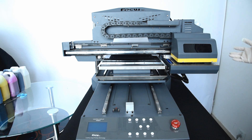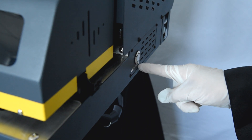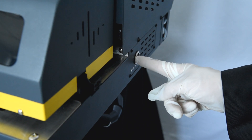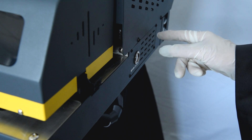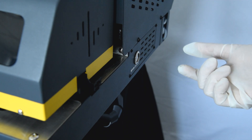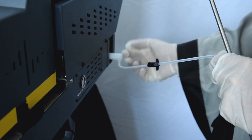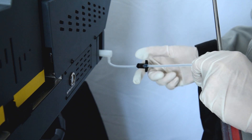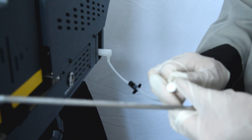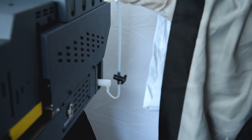When we go to the right side of the machine, we will see a button marked 'white ink circulation.' This is the white ink circulation pump button. When you push down, it powers on the white ink circulation. Inside there is also a timer controller that lets you set how many seconds to circulate. Also here is the waste ink tank — you can loosen two screws to take it out and release it. There is also a valve to open or close it: if the waste ink tank is full, you open it and release the waste ink tube.